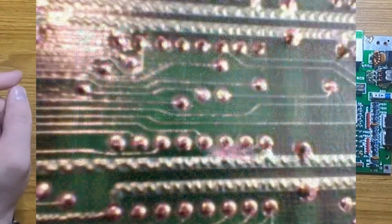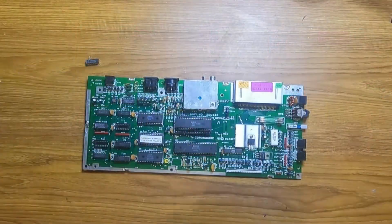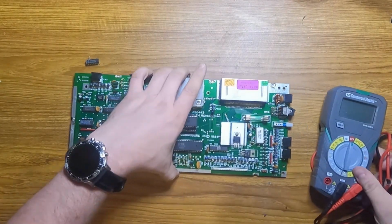Most of the write-ups that I've read online say to scratch traces on the board and run some bodge wires underneath. That's pretty destructive though, for a fairly simple mod. And since I already have these socketed and I have plenty of spare multiplexers, I'm going to add a pin header for addresses 14 and 15 and run it directly over to the legs pulled out from the chip.